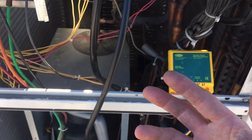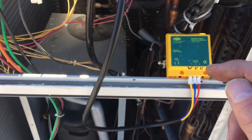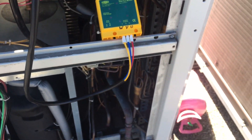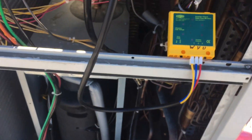Let's see what it is. Initially on this job, all it was was completely plugged air filters and one inside air handler control board was down, so the motor didn't work. But the technician thought, let's throw in 20-plus pounds of refrigerant and that'll make it work again.